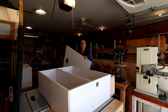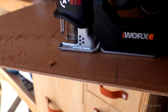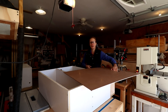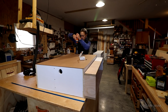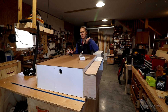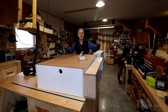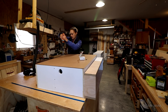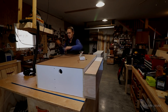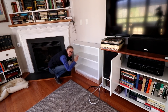On the bottom ones I'm going to be using this beadboard backing, which is nice and light and easy to work with, and I've cut out a section here for the outlet. Assuming that your cuts on the back panel are square to begin with, this is also a good way to ensure that your unit is square — because this one was a little bit out of square, but once you put the backing on, you can kind of adjust it and squeeze everything in place and get a nice square.